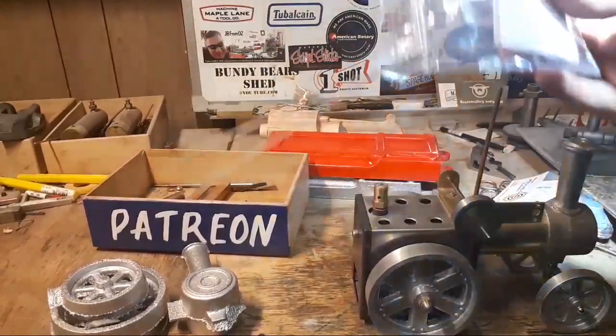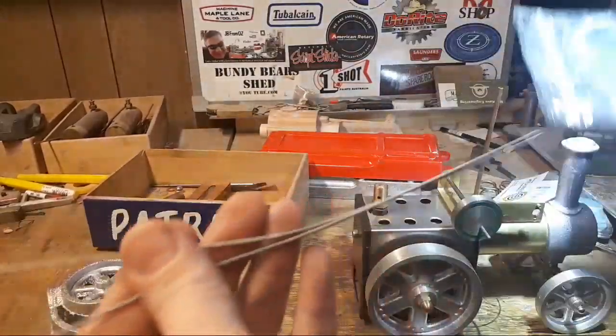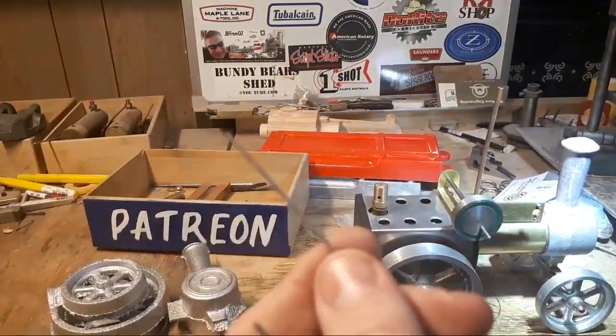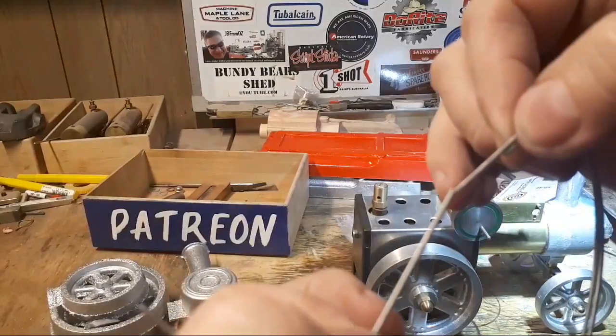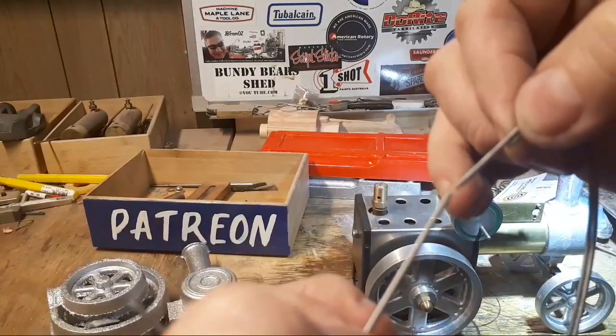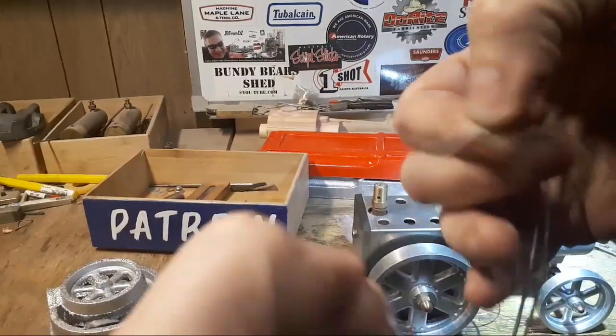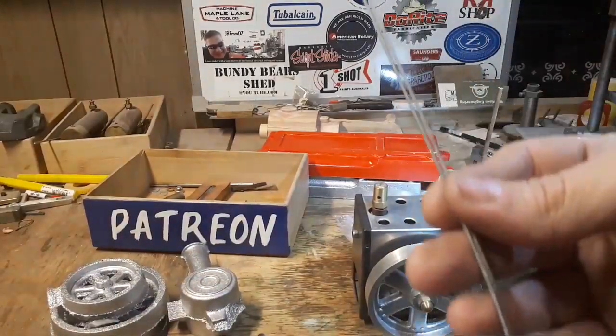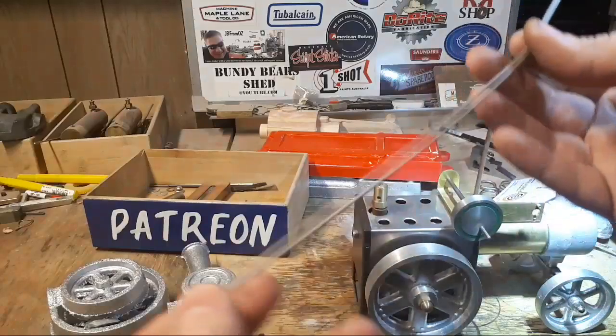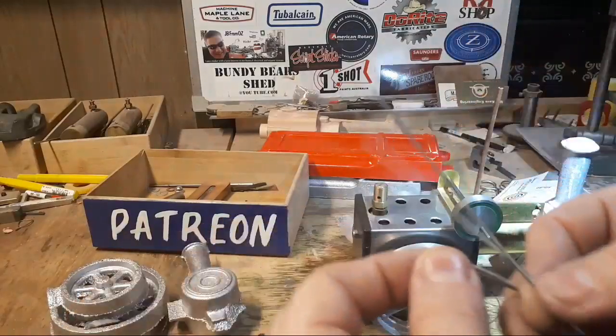We also got the spring belts which join up to drive the wheel. It's got a reduced end on one end and they screw together to make a continuous belt. So they come from England. They were a bit hard to find, but they're only about 16th diameter and there's two, I think they're 12 inches long.